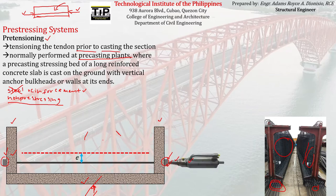Once everything is set up, a hydraulic jack is placed. The hydraulic jack will pull and stretch out the pre-stressing reinforcement — the tendon. The force applied by the hydraulic jack on the tendon is called PJ, the jacking force. That is what we call the jacking force.